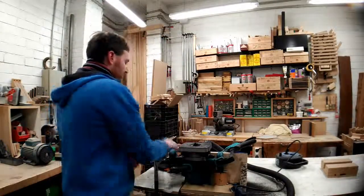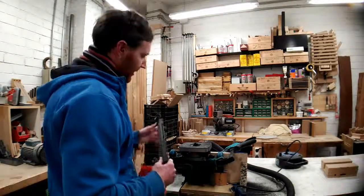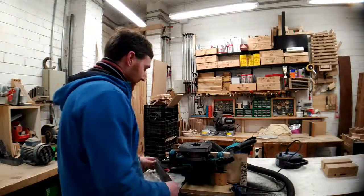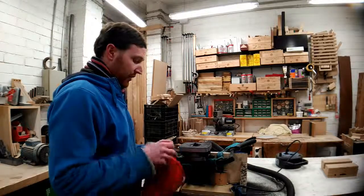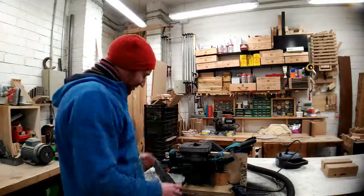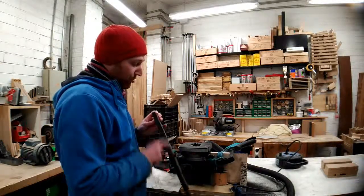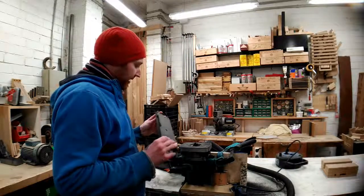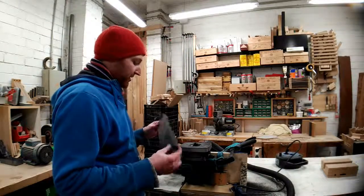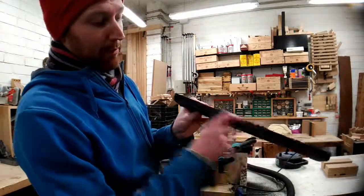So what you'll probably notice, you can see when you're fighting against the tool, you can tell that you're going against the direction it wants to cut in. So you're effectively doing a back cut. I demonstrated that by using the same cut in more than one direction. What does it do? It produces a bit of burnout. In practice, a lot of router bits can actually handle cutting in both directions. You can see there's a small amount of burnout there.